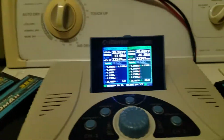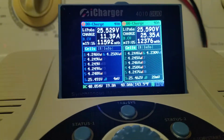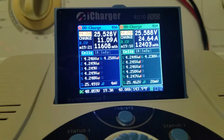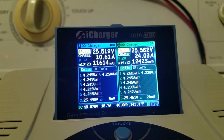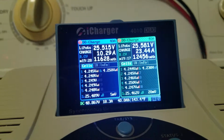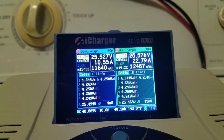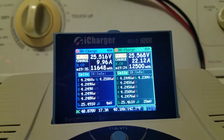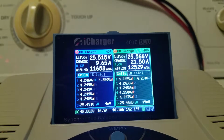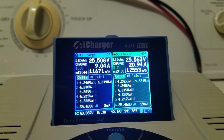There, bring it back in, and the other side is backing off. I'm doing a test of 4.25 volts per cell. We're going to check at the end of the charge when the Charger kicks off and see if they stay at 4.2 volts. Because I noticed a little bit of sag in them after the Charger kicked off. They dropped back to 4.19, 4.18, so I'm just trying to give them just a little bit extra, see what happens.